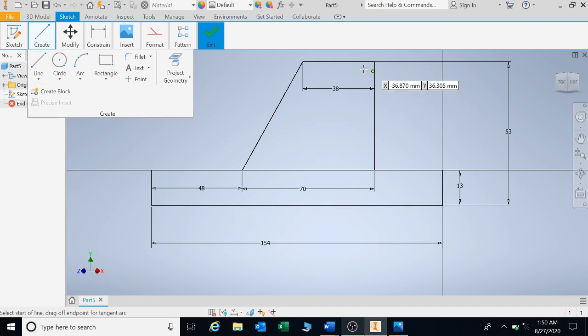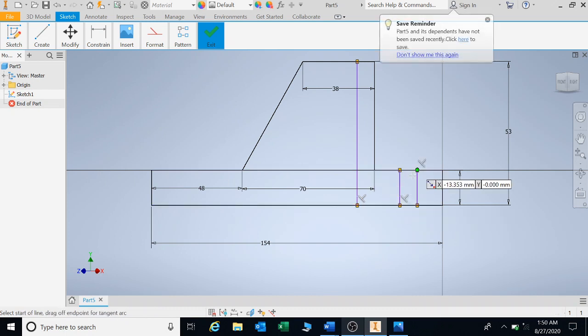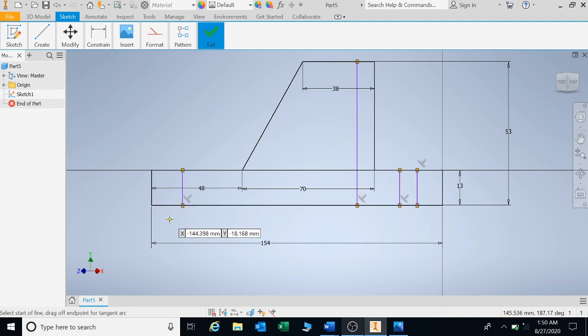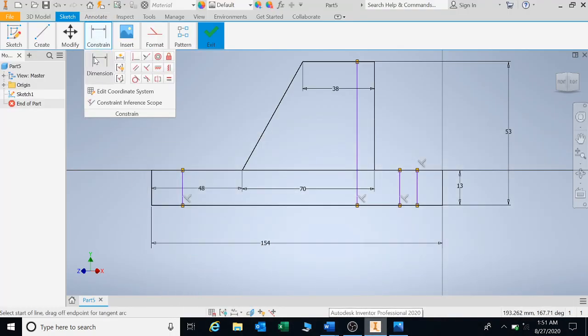Now, when you double extrude, you have to draw your hidden detail lines as solid lines. We have those lines, and then we have another line here. We need to look at these distances — it's very, very important. The distance from that point to there: looking at the drawing, we're having 48. This radius there is 25. So 48 minus 25 will give you 23. So let's go back to our drawing and put in a distance of 23 there.